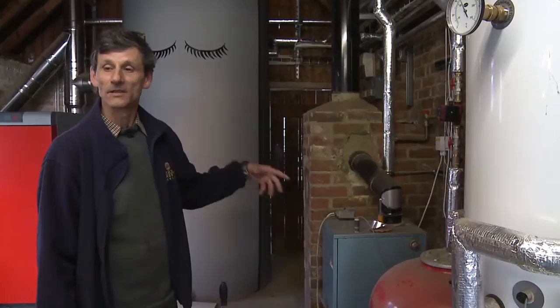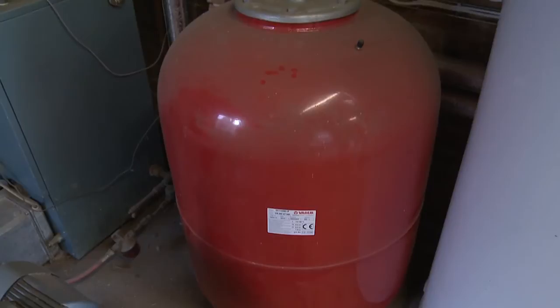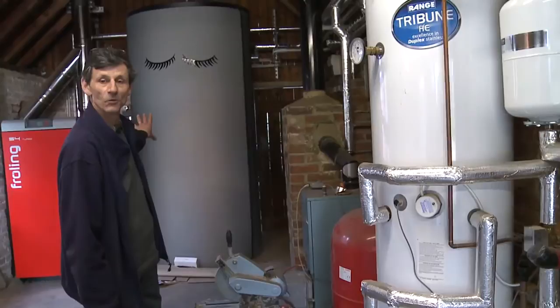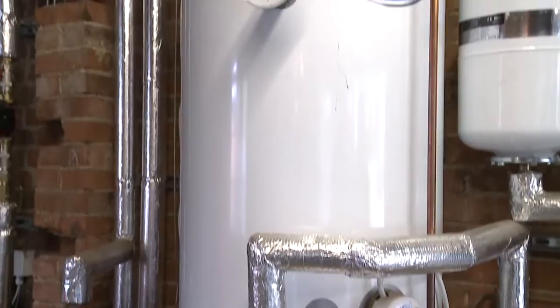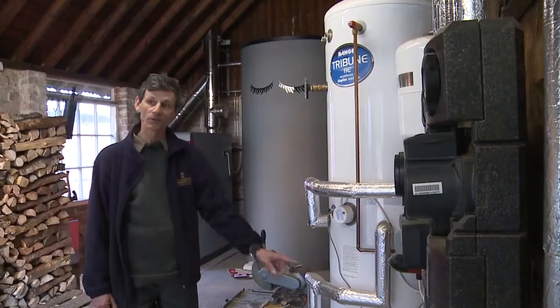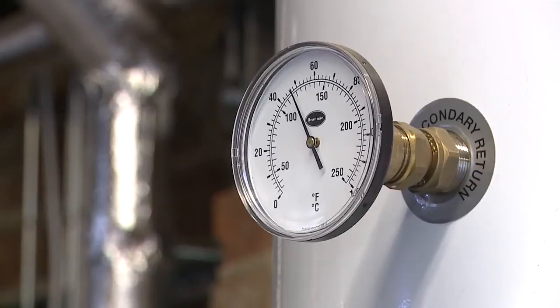This is the old oil boiler that we've kept so that if there's a sudden drop in temperature or we go away on holiday, there is a backup to provide heat. The wood boiler controls that oil. This is the very large expansion tank needed to act for this accumulator tank - because of rising and reducing pressures with heating and cooling of the water, you need a large oversized expansion tank. In this particular domestic hot water tank, we've got a twin coil one - it does any heat source plus solar. My plumber was quite ingenious: he looped the whole system through so all the heat goes through twice, meaning we get twice as fast recovery on heat. I've watched this rise 20 degrees in 20 minutes, which is pretty amazing.